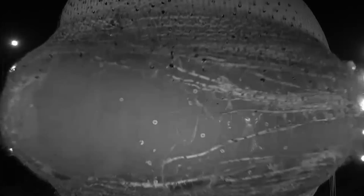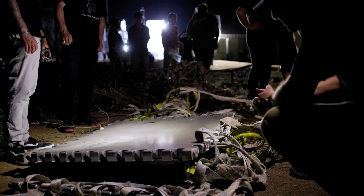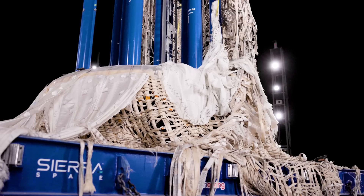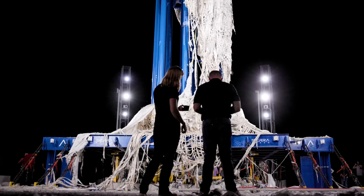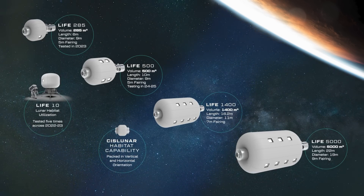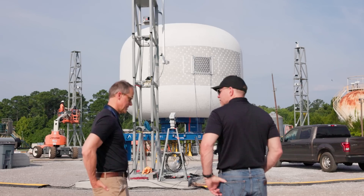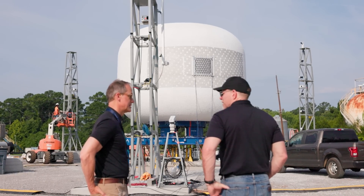Great test, great results. We're very happy. We got within five percent of our full scale — we updated the blanking plate design so that it's lighter and accommodates a larger window, and still hit within five percent. Just fantastic results. This is the second time we've done a burst test back-to-back for a full-scale LIFE 285, and this demonstrates that Sierra Space is leading and building real hardware. We're designing our LIFE 500 — eight blanking plates, nine meters in height, nine meters in diameter. We've got two more subscale LIFE 10 burst tests and some creep tests to do. Our goal is to build platforms in space to benefit life on Earth. This is serious work for us. We're going to make a difference. We're going to change the world.